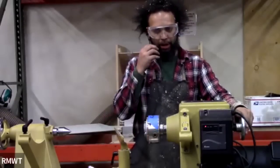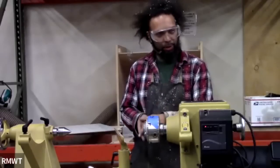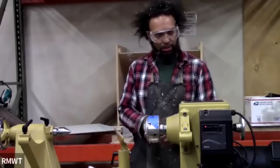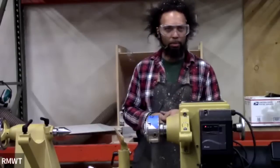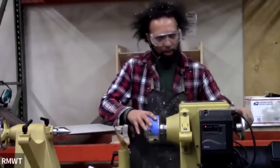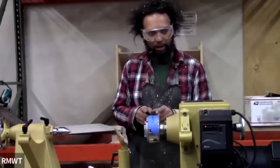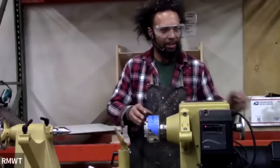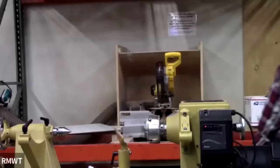Yeah, basically, I do. And that's to say on the down slope of the curve, getting down into the corner. It's ever so slight, maybe no more than an eighth of an inch of it. It's a very small little area. So there's a point where you're releasing tension from the bevel and you're more or less right on the point, but there is still bevel contact. It's still there. It's just very minimal. But yeah, good question. Thank you for that.